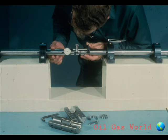Once you have determined that the coupling and associated parts are the right size, you are ready to align the two pieces of equipment. This alignment is very important and is a rather complicated procedure. For that reason, we will not go into the alignment in this module other than to tell you that the alignment must be completed at this point. Once the shafts are aligned, you are ready to install the coupling.